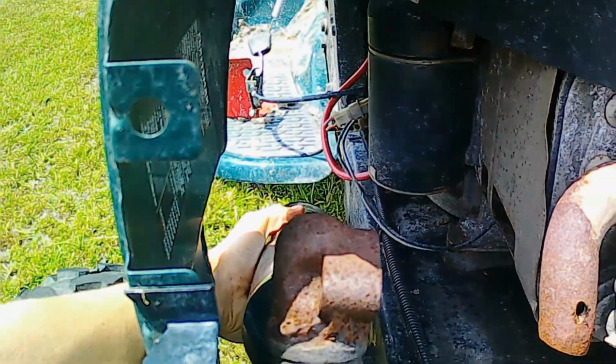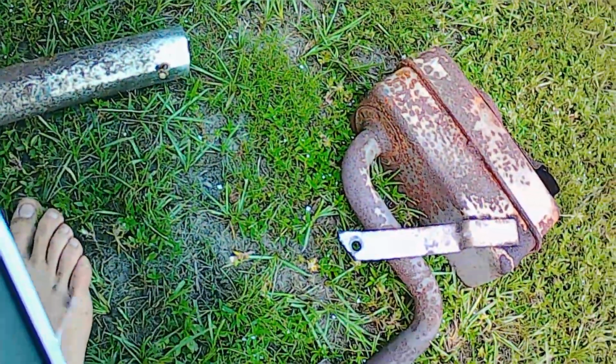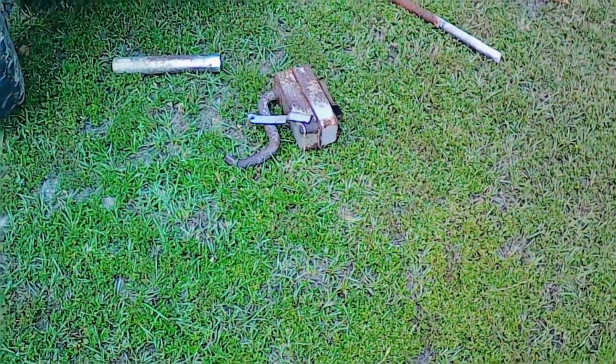just like that. But I got to get a little piece to go from there to there and cut that off too. And probably tack it down there. Yep, so I got to get a piece of pipe out of that. The measure's like 5 inches, so then we'll go ahead and cut like 5 inches out of that pipe, and then we'll start welding.